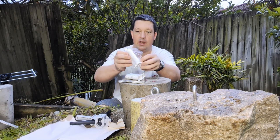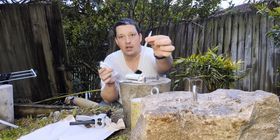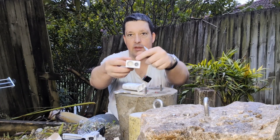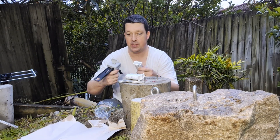So I grabbed a couple, grabbed a little sample kit — and check that out. It really is just one of these tiny little Araldite-style containers. It is three to one — you can see that this side of the cartridge is smaller. Three to one is what your pure anchoring epoxies are.